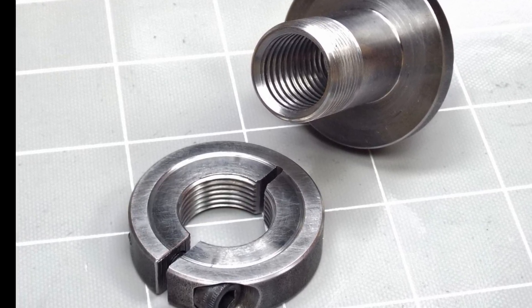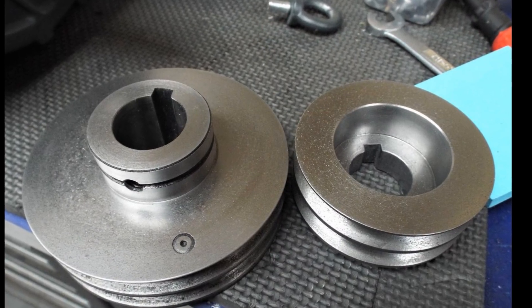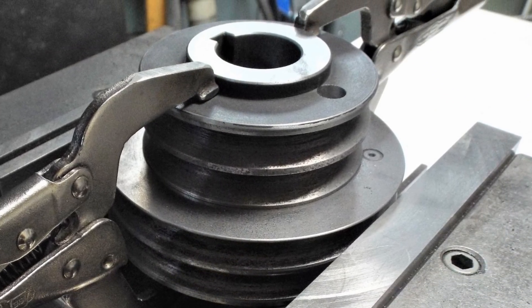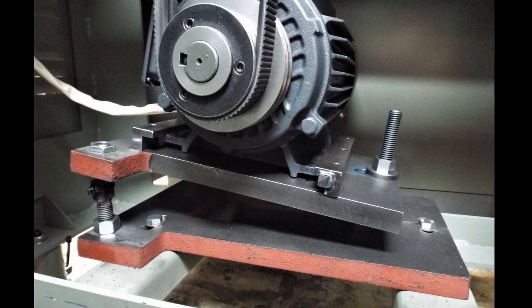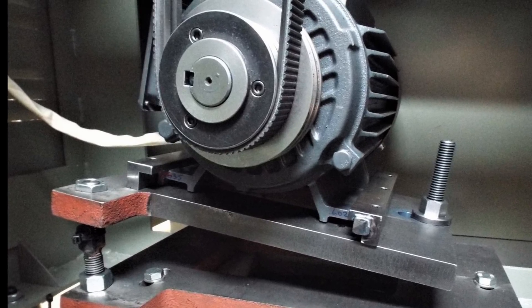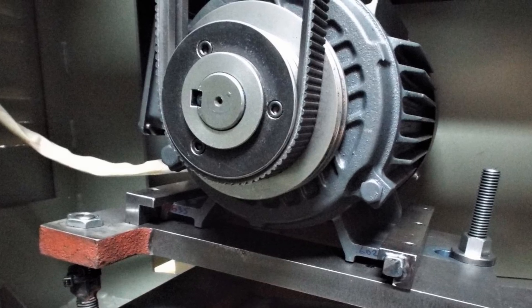Here's how I modified the two pulleys to mount the small one on top of the large one — a little bolt circle action to hold the two pulleys together. Here are the pulleys mounted to the motor. Here's the completed unit — obviously the cordless right angle drill with the socket is part of the system. I hope you found this useful; if you did, please subscribe and thanks for watching.